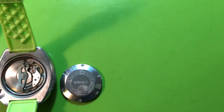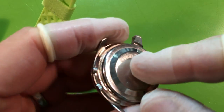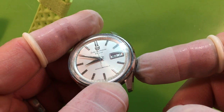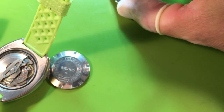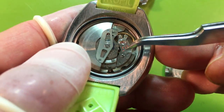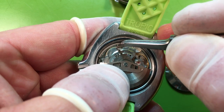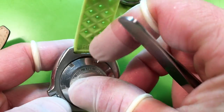The third watch is obviously not a runner — we knew that. It needs service but cosmetically it's very good. The crystal should be replaced but it's not too bad. Now on this watch we can see again that 6119 orange text, but look at all the movement on the pivot — that thing is just shot. We're going to need jewels top and bottom on that, guaranteed.